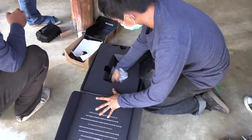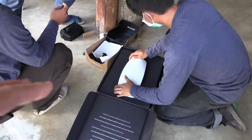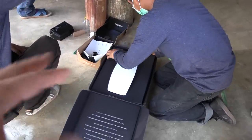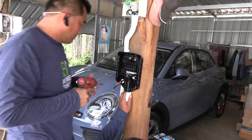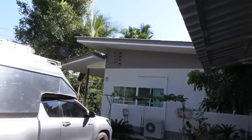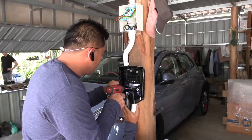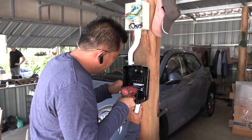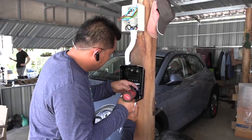Since we've taken out the old Tesla Wall Box, I'm going to donate it to my mom — she has a resort and will make it available for customers. Here we have the Easy Box installed. We only use one phase here; I actually have three phases going into the house, but for the garage one phase is good enough since not every car supports three-phase onboard charging. With one phase I get around 7 to 7.4 kilowatts.